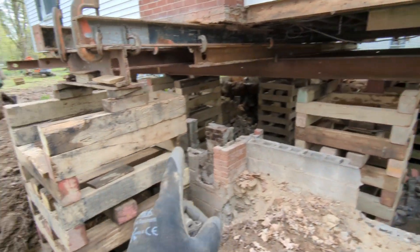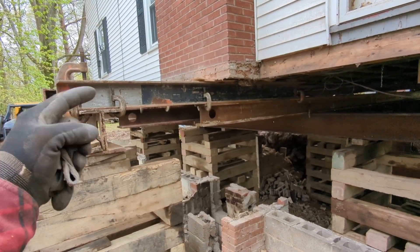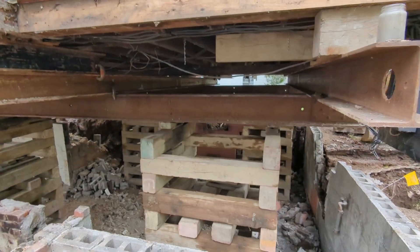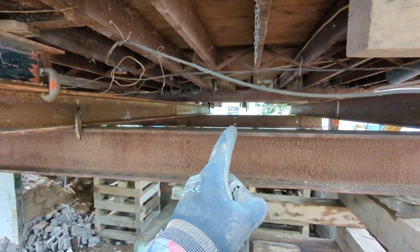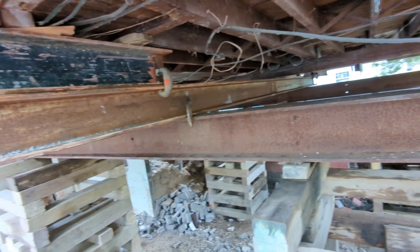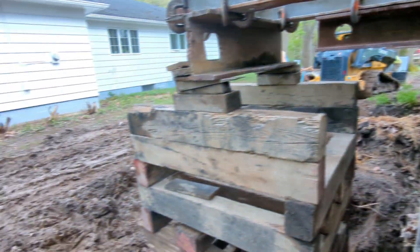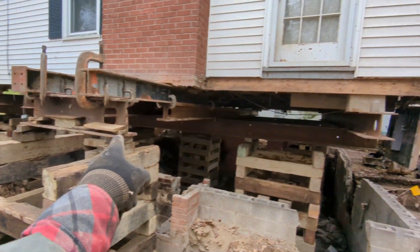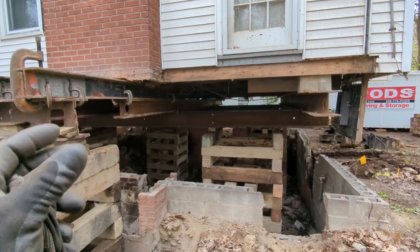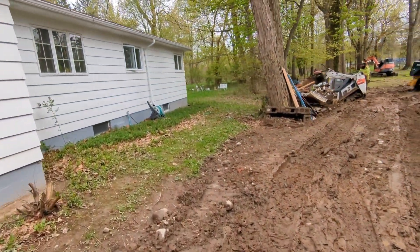If these beams could have been longer he would have still been underneath their ends with this I-beam, but coming in here past the house — this is what you do if you can't actually install what you need. Just like I said when I first showed up here: blocking up to it wherever you've got to be. Now, getting the main beam out and the original removed — the new one will be installed from beam pocket to beam pocket across the new foundation with posts underneath. As we come down we've got to get out from underneath and around that original beam so it can be cut and removed, so that area is clear when we finally land onto the new steel. We'll see that operation next week probably.